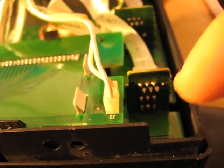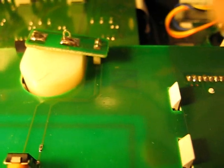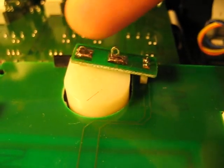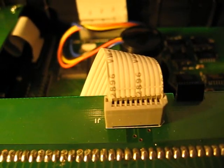This is what you'll see. That's the DS2 there. There's the meter. If you want this board out to replace the tube — the CCFL — you'll have to desolder those two there. Then the board just drops out. I'll just leave it away so you can get to replace it.